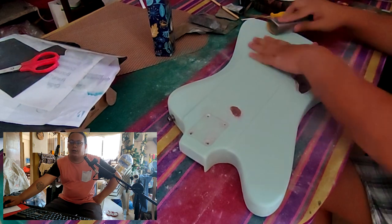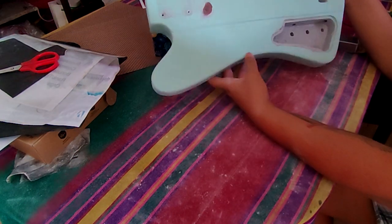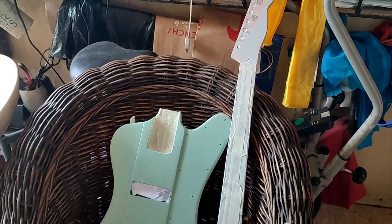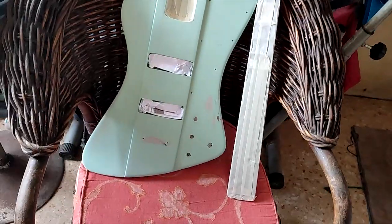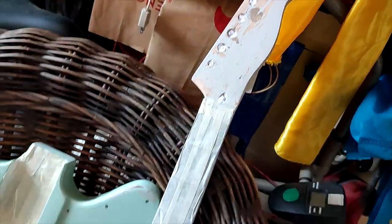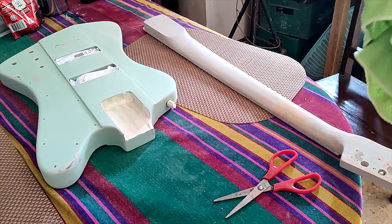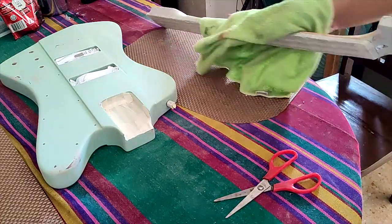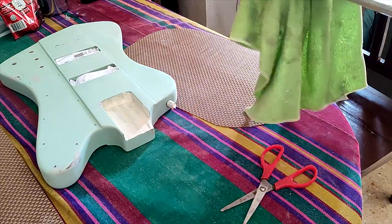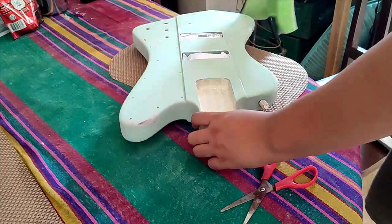Brushing out all of the clear coat and then leveling the epoxy primer. Putting paper and covering the fretboard before painting. So this is a good tip for you before painting anything: use a towel with detergent powder and some water. It's actually a good degreaser and oil remover, rather than buying one from the store.